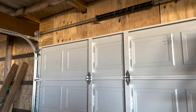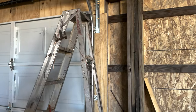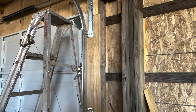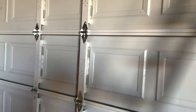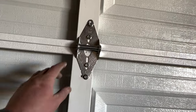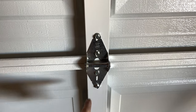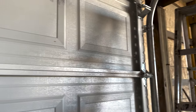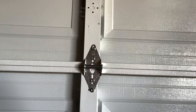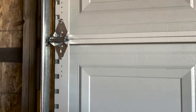And that took over half a day. And then the door went up fairly well. We did run into some issues with just some screwy stuff. These doors, it doesn't matter what you buy, they're just junk. For some reason, these ones weren't lined up, so I had to move the brackets, whereas the rest, everything lined up fine. And it isn't that these panels are shifted. The ends down there, it's all flush. It was just a half inch off on just two of them because it's built in China, I guess.